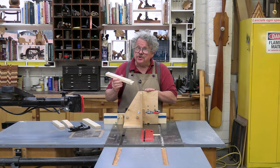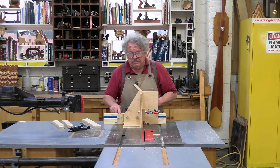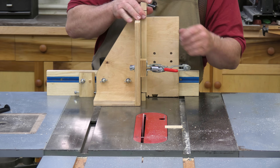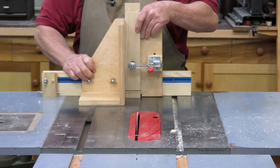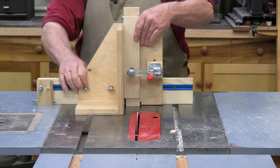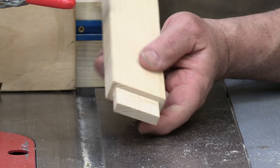If you need to reposition the jig just a little bit, use the micro adjuster on the stop. When you ensure the jig and the blade are positioned correctly, cut the cheeks with the clamp mounted in the side. Then cut the edges with the clamp mounted in the back. Here are the freshly cut tenons — very clean, almost no tear out.